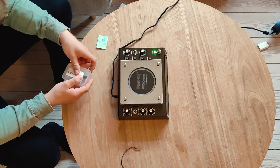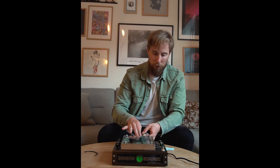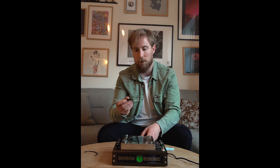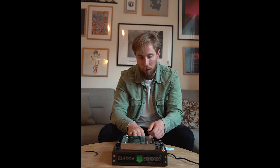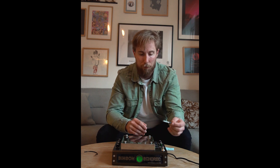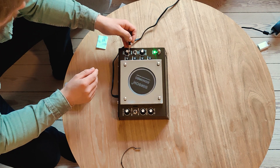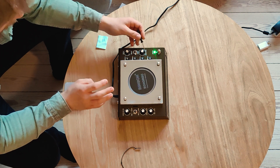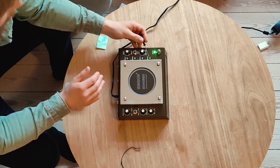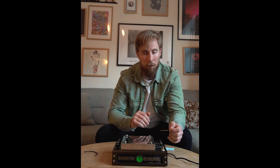The last thing I'll mention about the toolbox is that the screwdriver is made for adjusting the playback level of the four heads. Right now the first playback head is the softest of the four. The second and third heads are slightly louder, and the fourth playback head is the loudest — so the volume goes up across the four playbacks.